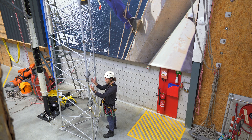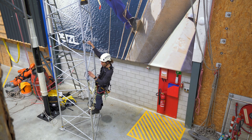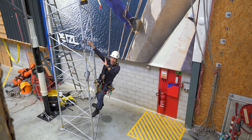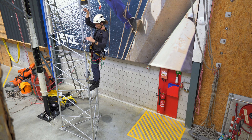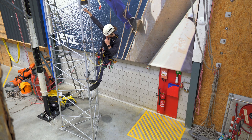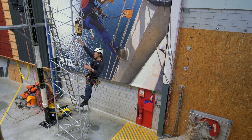What I'm doing is attaching the hook as high as I can, and I'm either climbing or moving the hooks — I'm not doing both at the same time. I climb up until I'm at the height of my top anchor point — that's two steps. I'm at my top anchor point. I get my bottom scav hook and reach as high as I can. I check that the gate is closed and do two more steps. Because if I do one more I would actually climb past my anchor point and be at fall factor two. So I take my bottom hook, place it as high as I can reach, check the gate is closed, and continue climbing.